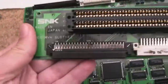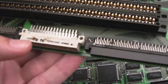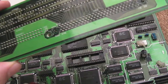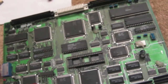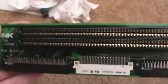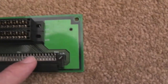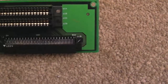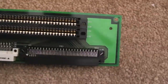The final step now is to clean up this connector — as you can see there's some more corrosion here, just the same as what was on the top of that ROM chip. I know that this bridge works fine and there's no damaged traces — it's just purely cosmetic stuff. I used a wire brush to get the initial surface corrosion off on both sides, then used fine grit sandpaper to go over the contacts, and finally some isoprop brushed in and around the pins.